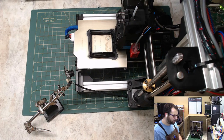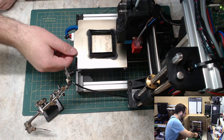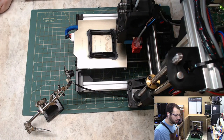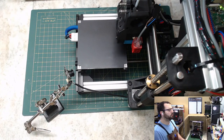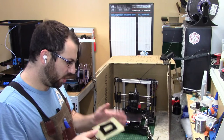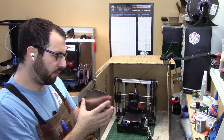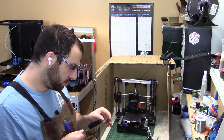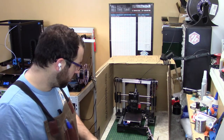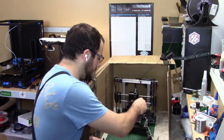Okay, I gotta change my cancel print macro for one, because right now the default cancel print macro decides to send the nozzle into the bed. So, let's see here. Instead of waiting for it to cool, hold it down with your finger. No, we're getting really hardcore layer separation, and it was really bad bed adhesion as well. So I know I gotta drop this corner, because that corner was way too high.